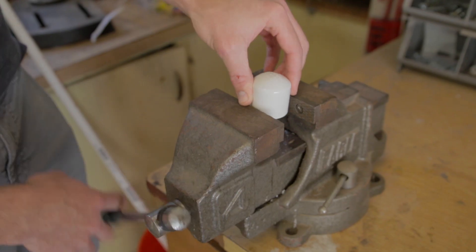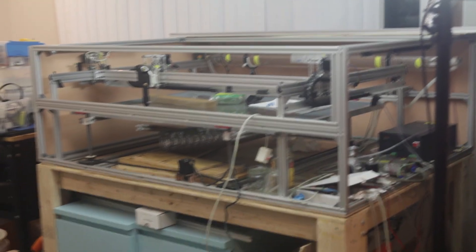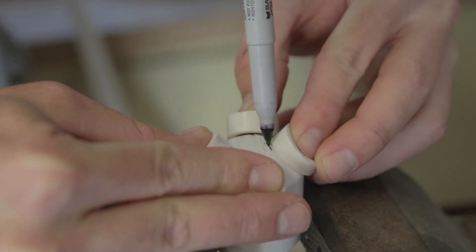I'm gonna put the end cap in the vise and drill the four holes. Before cutting it I'm going to cut off a small section to use as a template. The reason we're not using the laser cutter is because cutting PVC on a laser is a huge no-no — it releases gas which is super caustic to the optics inside your system, and it's really poisonous.